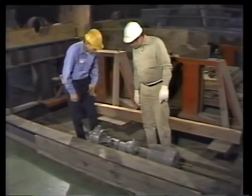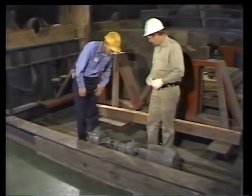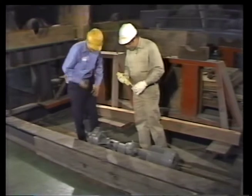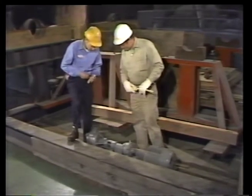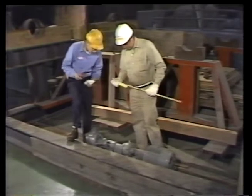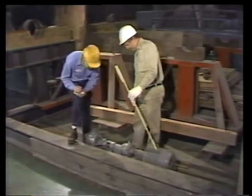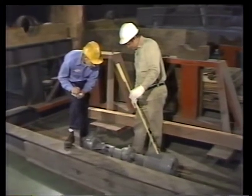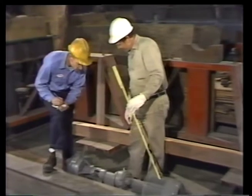After finding the weight, Norris estimates the balance of the load. Experience has shown that the pump will be the heaviest part of the load. As he eyeballs his sling lengths, he figures that the balance point will be off-center, closer to the pump. If the load's picked up from the center, it'll tilt. To level the load, the main load hook has to be directly over the center of gravity.